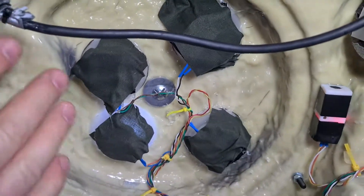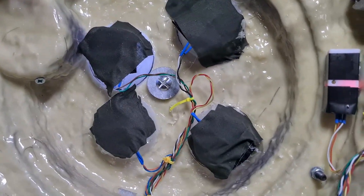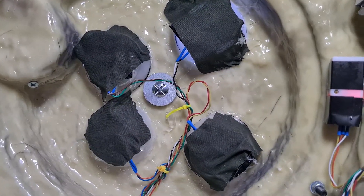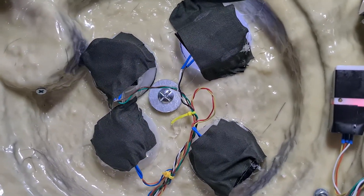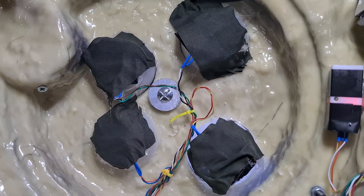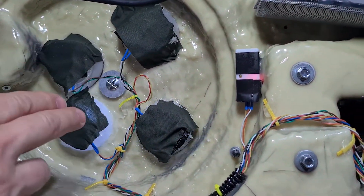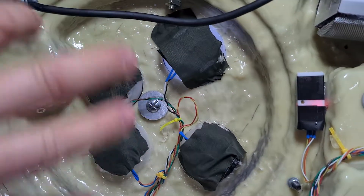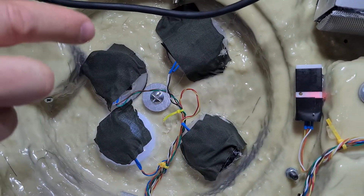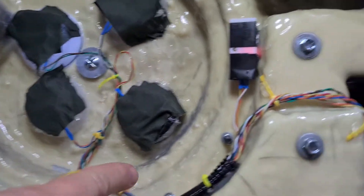Following this wiring loom through the pack, all the way up to the cyclotron lights — those use the same LEDs to create the light source, but the light is diffused through a polystyrene sheet, an idea taken from a greetings card. Those are also driven by the same port expander. The lighting sequence is all programmed in the Python script, and that script will automatically run on startup — i.e., as soon as you apply power to the Raspberry Pi Pico.